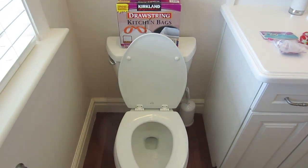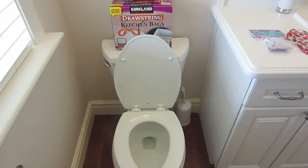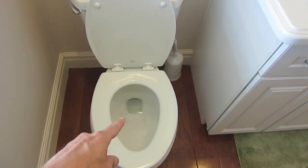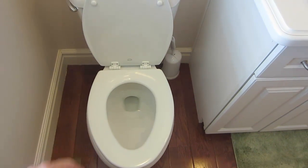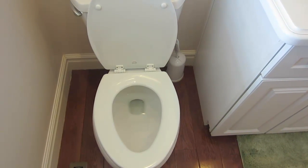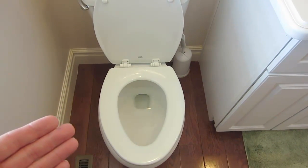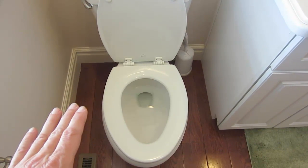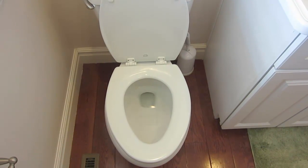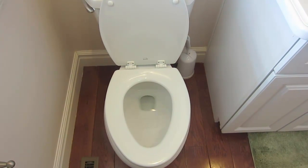If you're in an off-grid situation and you don't have water supply, you're not going to be using your stored water to flush toilets. So this is a very simple solution. First thing you would do is you would plug the hole down at the bottom of the toilet. The reason for that is if you're in a flood situation, there may be backflow coming back through the sewers or septic systems. You don't want any of that coming back out of the toilet. Also, if you're using the toilet as normal and you can't flush it, you may attract rats and other pests up through the sewer system — you don't want cockroaches and rats coming up through your toilet into your house.